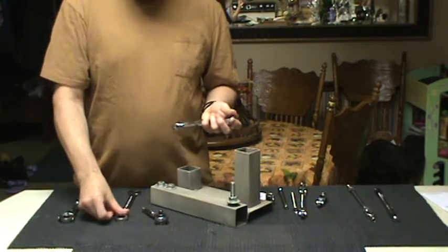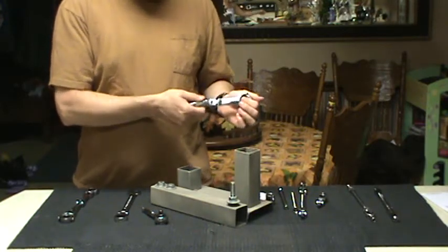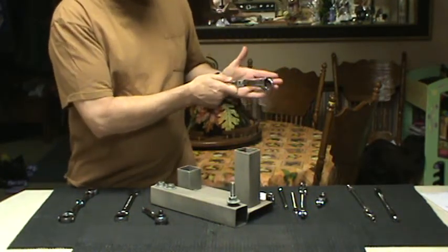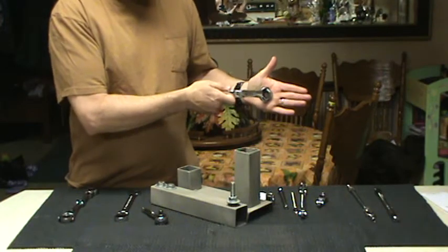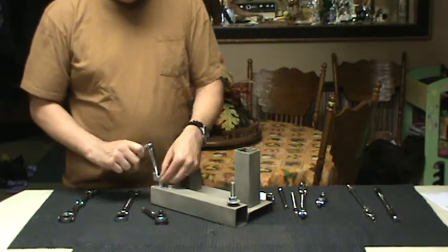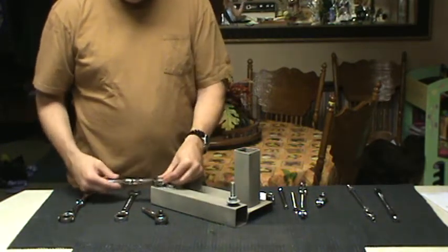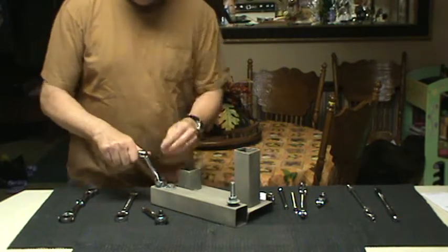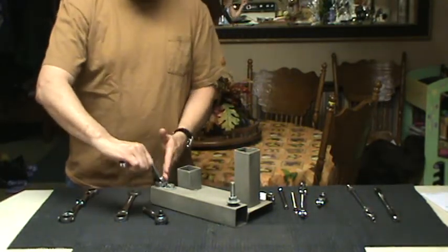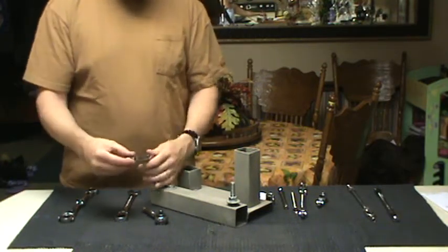The problem with the other one, with the plane of rotation not being with the work, I've eliminated, because the flexing handle, you literally keep your piece of work at the same angle as the handle, no matter what angle it is. 90 degrees even. It's straight up, straight down, doesn't matter. I can keep the wrench with the bolt. If I need a lot of force, even way up here, I still get the right plane of rotation. It isn't a twisting action, it's a turning action.